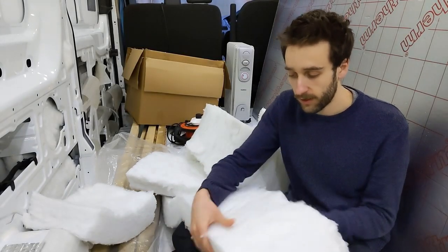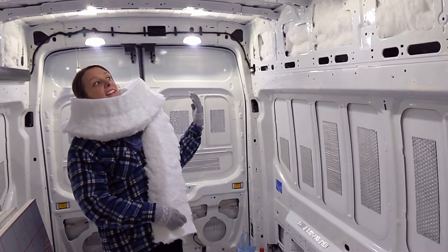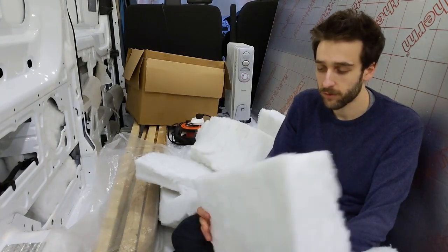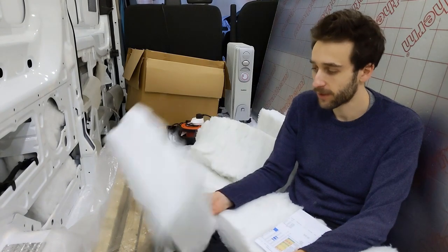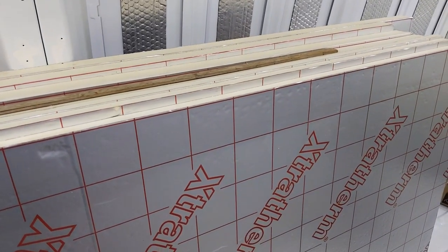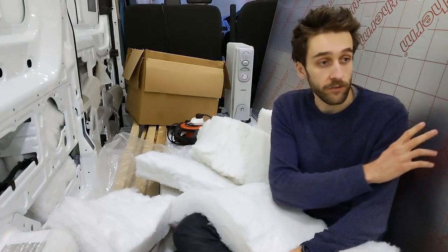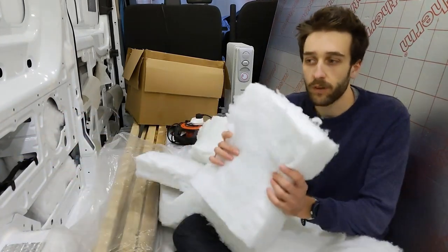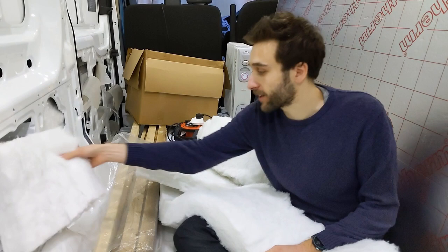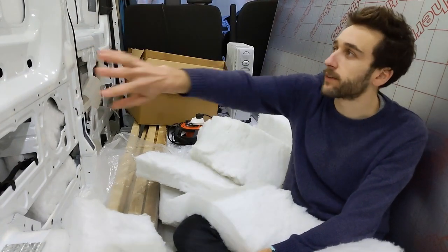We've got the Therma Fleece super soft, which is made from 100% recycled plastic bottles. You would not think that at all — it's like a nice white duvet, really nice and soft. Cuts well into pieces. It's also pretty cool that it sucks up all the empty plastic bottles from pollution and converts them into something useful. And then we've got this rigid foam board here — it's called Extra Therm, it's a PIR board. It's basically the same as Celotex, Kingspan, others like that — just the brand name. They all have exactly the same thermal properties. We've got two different types because we've got these cavities we've been stuffing with the soft stuff. This is a hundred mil thick and these cavities are exactly basically a hundred mil thick, so it's a natural fit and they're held in because of the shape of the hole.